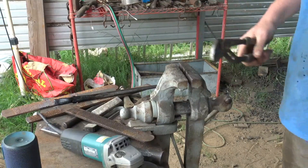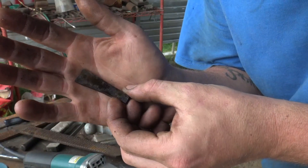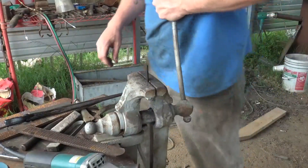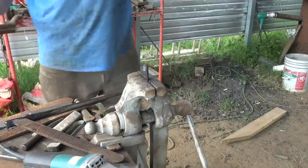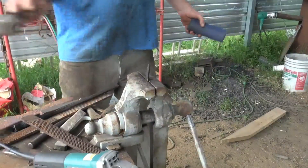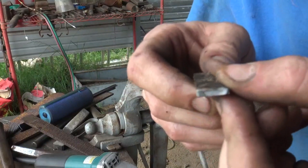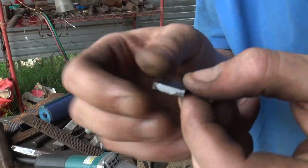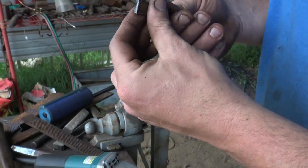So we know it's hard. We are going to now temper it. Nice dark straw — almost purple. Let's see how tough it is. It started to bend before it broke. The grain is just phenomenal. I think this is going to do well for some blades.